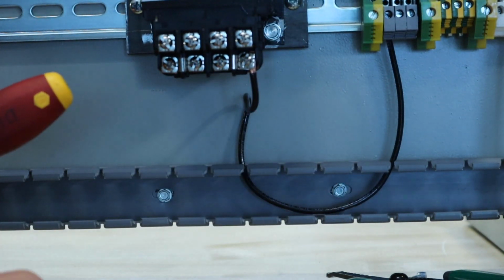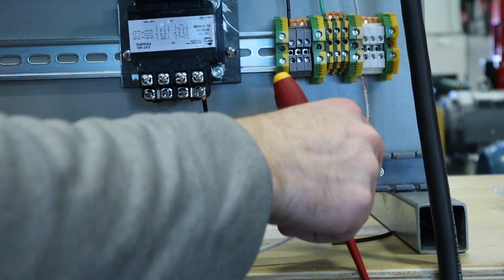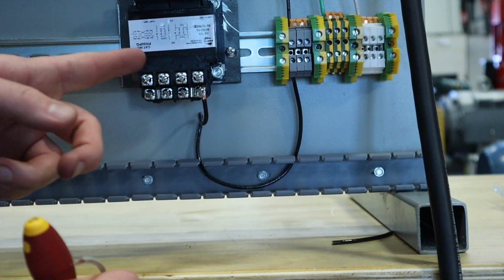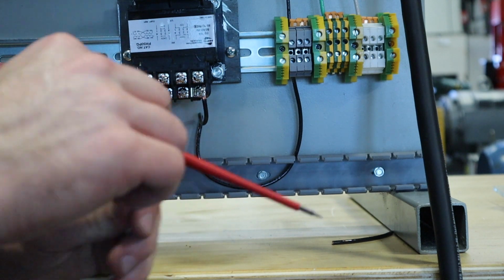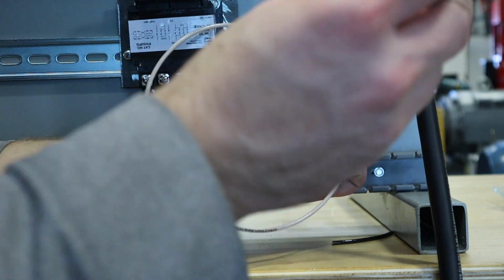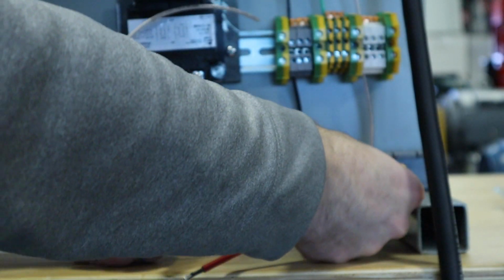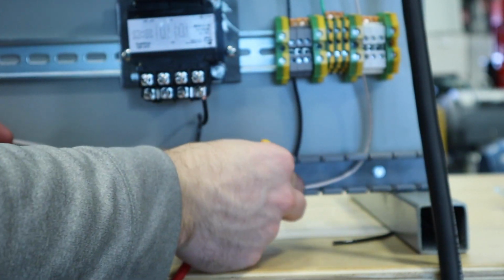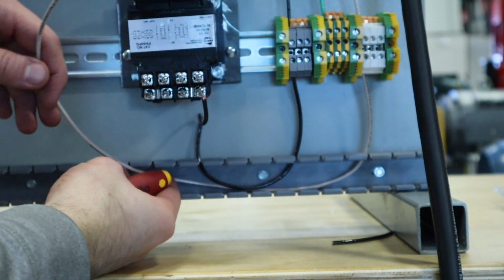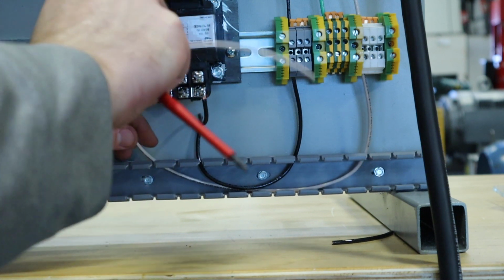And then you want to, again, make sure these wires are nice and tight in place, okay? All right, now we're going to take our neutral wire and put it in and then bring it down and hook it into terminal, I think this one's number 4 over here. It doesn't really matter which direction you hook up these wires. It's not polarity sensitive. It can be hooked up to either one. So come down, bring it in. Again, I'm just going to figure out which one it lines up best with. Looks like that one's going to be the closest.